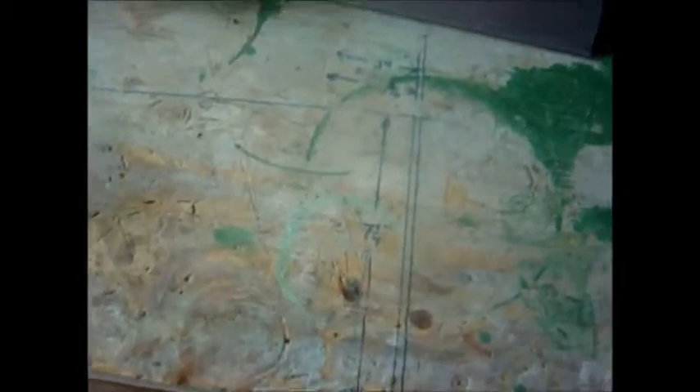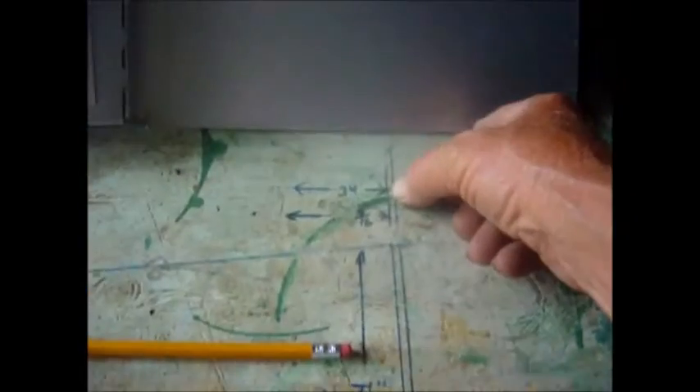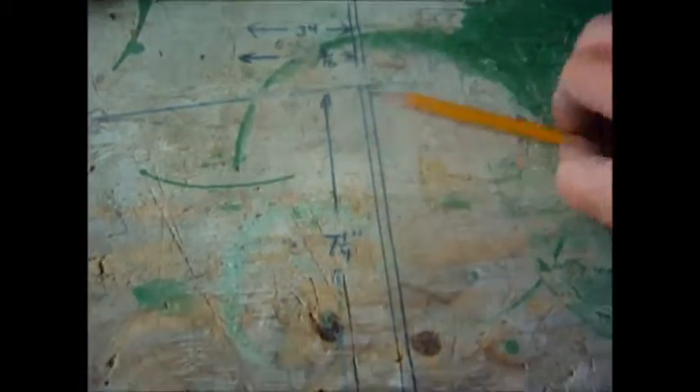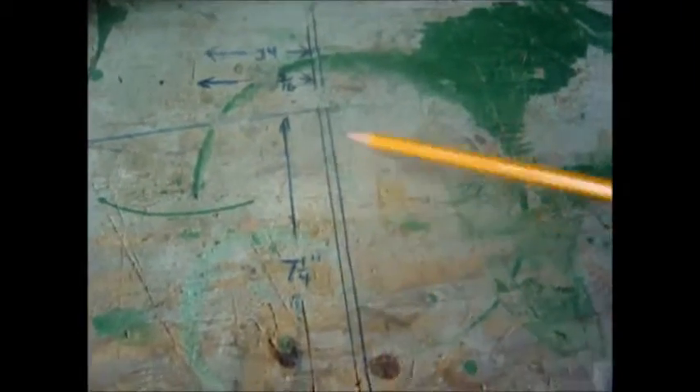Here's what happens. I've sketched out on the bench a cross section of how the top looks when it comes down here. The glass itself sits on the top, and when it's going straight, the measurement is 34 inches. When you start tilting the glass up, this distance decreases — keep in mind this top is going to be square straight down. You lose 3/16ths of an inch in this total length, lifting it 7-1/4 inches over this 34-inch span.